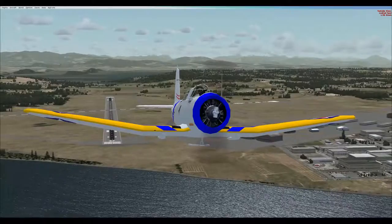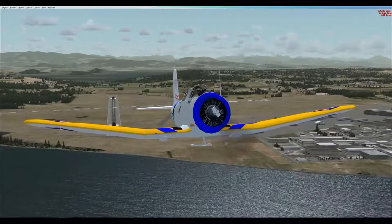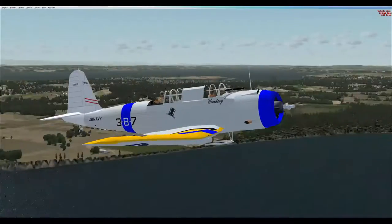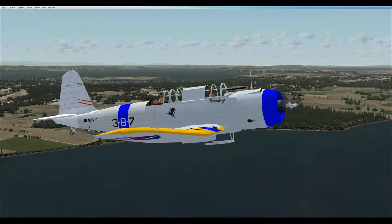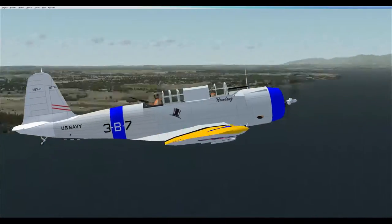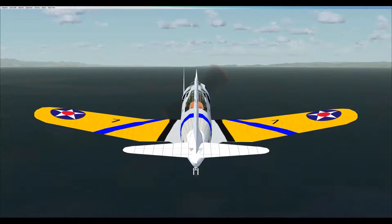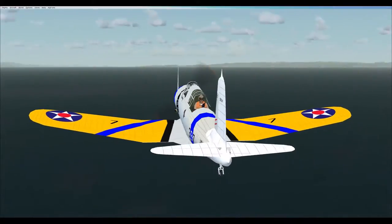The biplane was considered alongside the monoplane design as a hedge against the U.S. Navy's reluctance to pursue the modern configuration. The XSB-2U was a low-wing monoplane configuration with folding cantilever metal wings spanning 42 feet. The 34-foot long fuselage was of steel tube construction covered with aluminum panels from the nose to the rear cockpit. The rear half of the fuselage and all control surfaces such as ailerons, rudder, and elevators were metal-framed and covered with fabric.